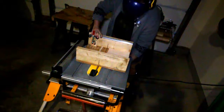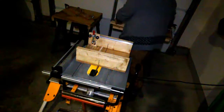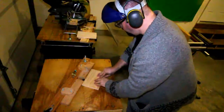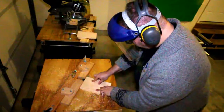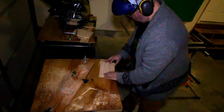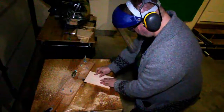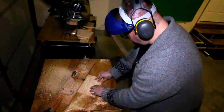Alright, so I'm just going to go ahead and cut the raw material down to the right dimensions. And I took it over to the router and cut a 1/4 inch groove. This is using 1/2 inch board, so I used a 1/4 inch bit, about 1/8 inch deep all the way around, on the top and bottom of the box. I'll have 1/4 inch plywood connect the sidewalls. Here I'm just cutting around this place to put the sidewalls, to have a little place to tuck them in.